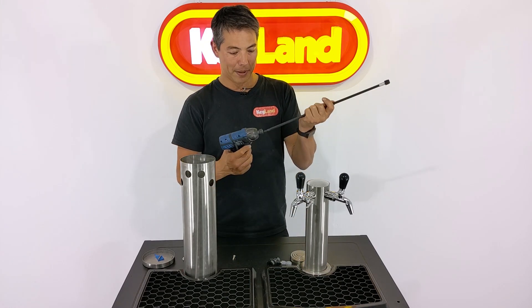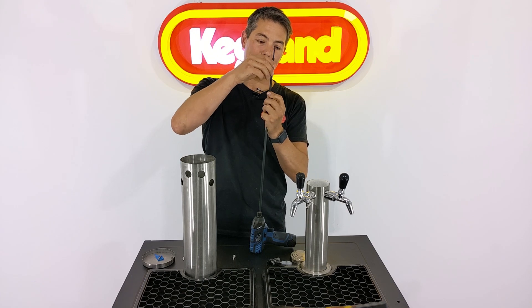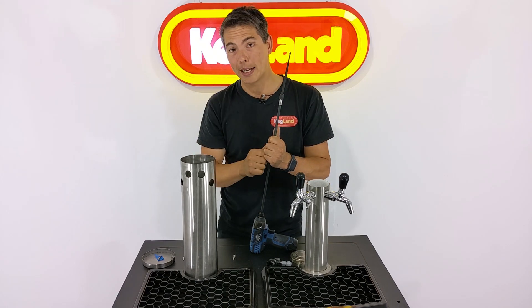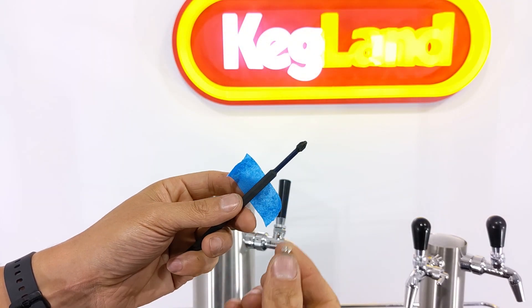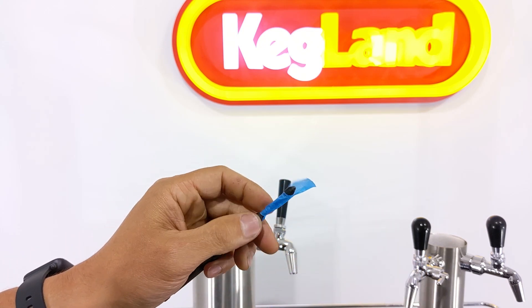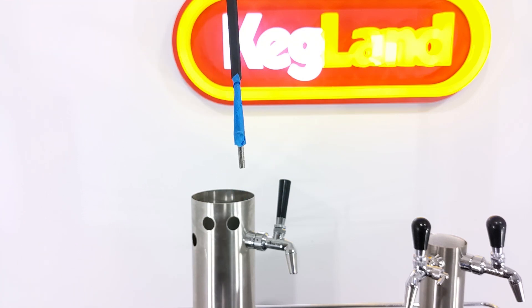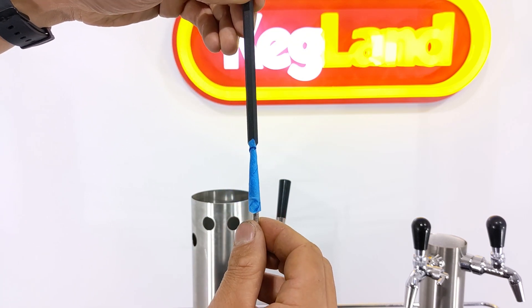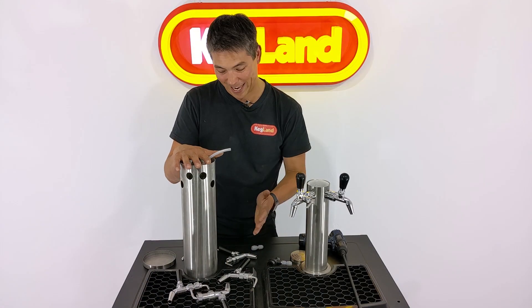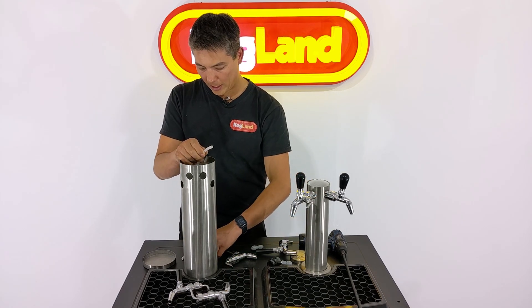With the four-tap font, it's different to the two or three tap font. The quad font requires the screws to go in from the inside, so you need to attach it first before filling it with taps and beer lines — otherwise you'll have to take all your taps out. I recommend using a long quarter-inch extender with a Phillips head bit on a 12-volt drill. A handy tip: if you don't have a magnetic drill bit, use masking tape. Wrap it around the drill bit, stick the Phillips head screw to it, and it'll hold the screw securely while you drive it in from inside the font.